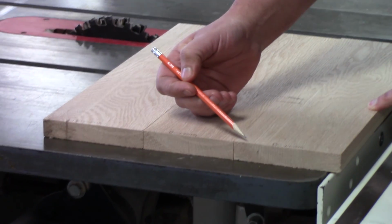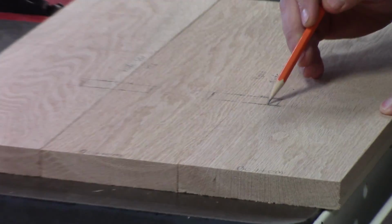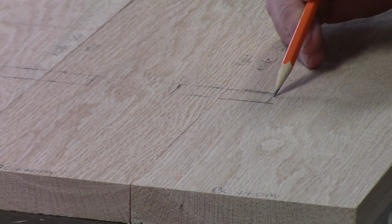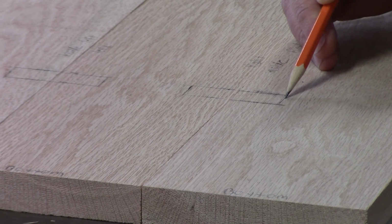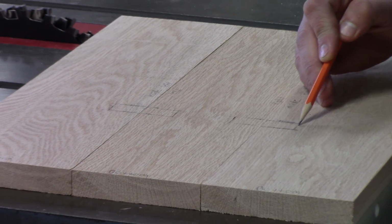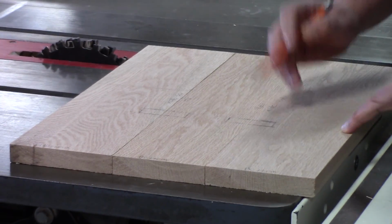If you look at your blueprints, your notch is 7 inches from the bottom. It's a 3/4 inch notch, so I measured 3/4 inch down, and it's 1 1/8 inch in. When this is all laid out, you are ready to cut. As always, if you are unsure if you've laid this out correctly, please grab your instructor so we can review it and you do not waste material.